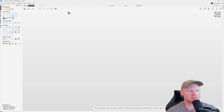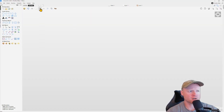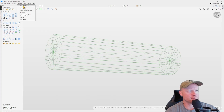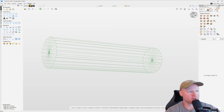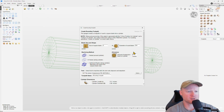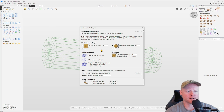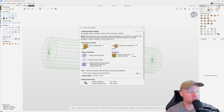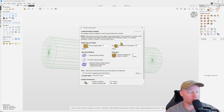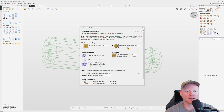Make sure your XY datum is set to the lower left and click OK. Once you're in, turn your 3D view on — click on this square button up here so you can get an idea of what you're looking at. I like to pop up my 'Show Toolpaths' tab. Now go up to Gadgets, then Wrapping Tool, and then 'Create Rounding Toolpath.' My blank is a hexagon so I'm not going to run a square blank — I'm pretty sure my quarter-inch Jenny compression bit can handle the excess on those corners in one or two passes. I'll probably end up doing about three iterations depending on where we're at after the first one.